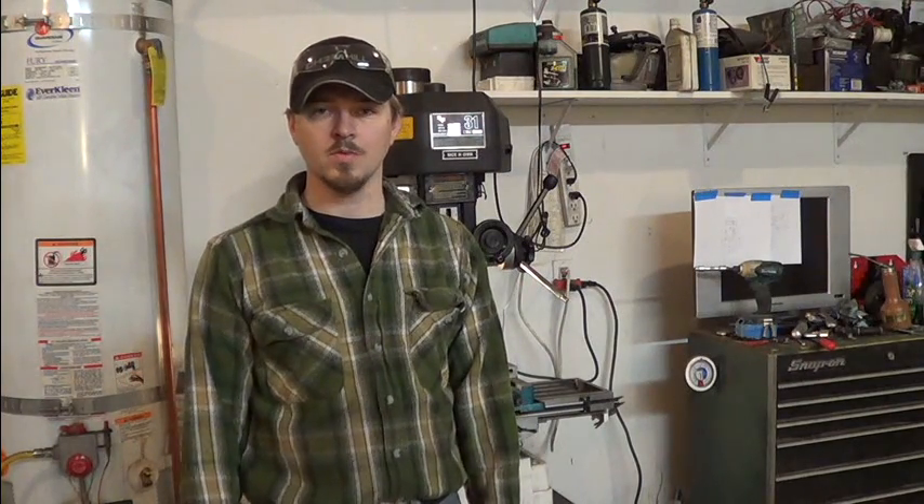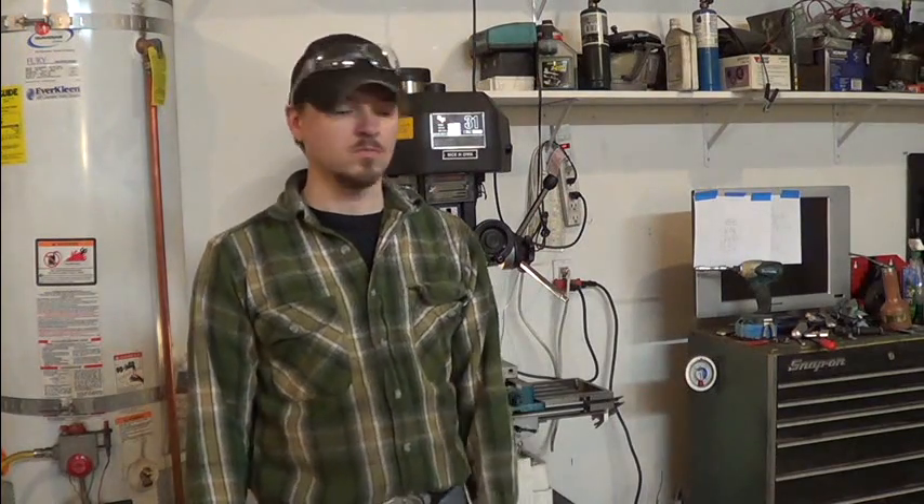I just got it finished — just got the table put together, and I still got the handles to mill, so I'll probably show some clips of that. Before I do that, I'm going to bring the camera over and show you what I did. It's probably not the best upgrade — there are things I'd like to improve. I ordered the X screw 100 or 200mm too long, but it's better to have it too long than too short. So I made a spacer and adapter for that, since I don't have a lathe to cut it down and get it remachined.